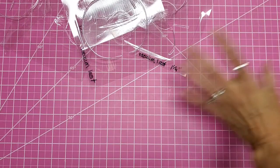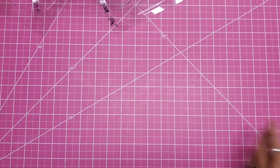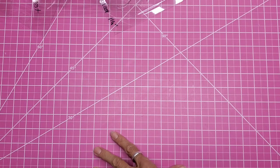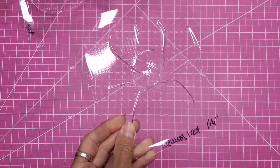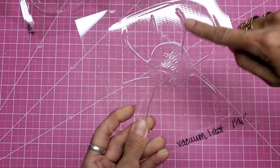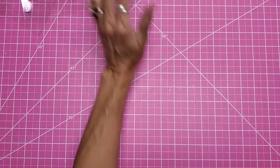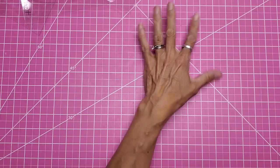One of my followers on Instagram suggested that maybe the temperature of the room is a strong influence on whether these veins occur in the project. And you can see this one, the veins go clear up the design. That's even worse than just on the sides like that. So, well, that made sense. The temperature theory made sense to me because I am in the basement and it's very cold. And she was saying that the plastic cools too rapidly.